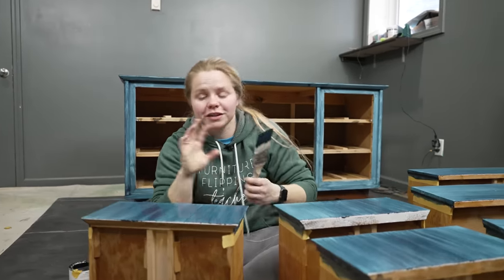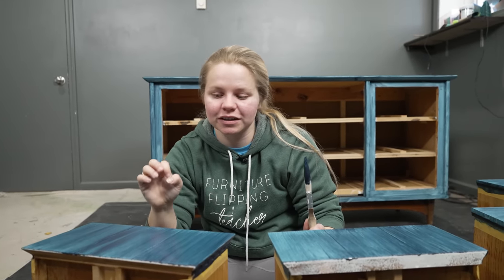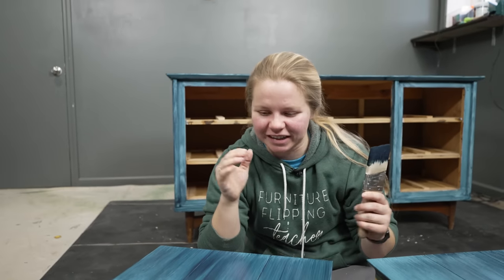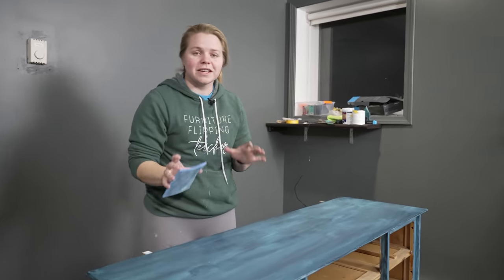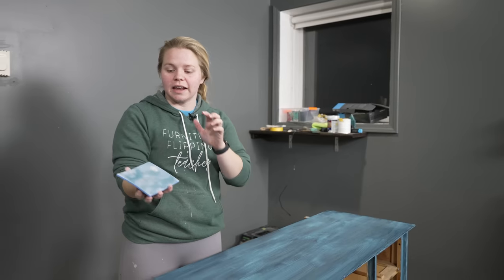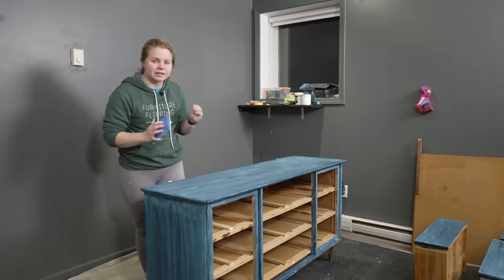We are finished with coat number one and this color is looking a little more teal than navy, so I'm hoping one or two more applications will make it turn darker and more navy — on my brush it looks darker. We're going to cross our fingers, let this dry, and come back for coat number two. Always sand between coats of primer and paint because it gives you an even smoother finish. I just use a very fine rad pad — a little sanding sponge — to take that slightly rough top layer off and smooth everything out.